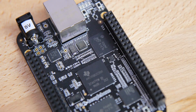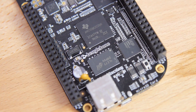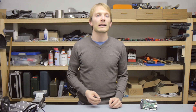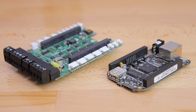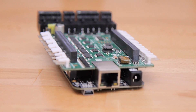And then there's the all-in, more-is-better class that builds on something like the BeagleBone Black, which is much closer to the processing power of your phone or tablet than to something like an Arduino. The BeagleBone Black runs Linux on a 1GHz A8 core, so instead of having to use a separate Raspberry Pi to get something like Octoprint running, that entire functionality plus the controller itself is now integrated into the BeagleBone with the Replicape. I'll be covering the Raspberry Pi question later when I talk about the soft side of things, but for now I want to start with the Replicape hardware.